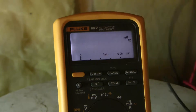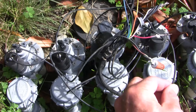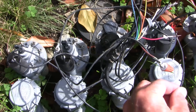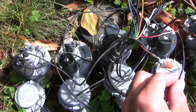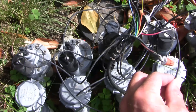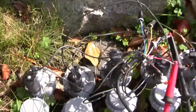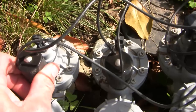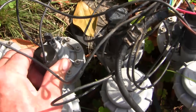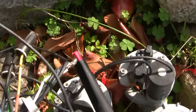Our next question is to see whether or not the power is getting there. Here I've disconnected the two wires feeding the solenoid and cleaned the connections. Then I turn the controller on to feed power to that solenoid — notice the humming sound the solenoid makes. Even with connections cleaned I'm still not getting any water to the grass. Now I'm going to look for power delivery to the solenoid to be sure there's no damaged or frayed wire between the controller and the solenoid. I'm doing a voltage drop test identical to the same test in automotives.